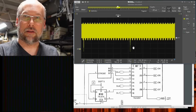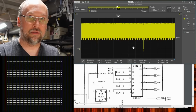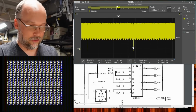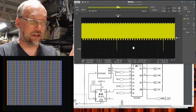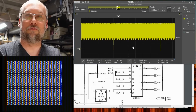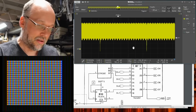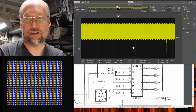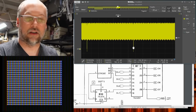Okay, so with the diagnostic running, if we go to the input pin on the 7th bit, there's stuff happening here. The problem is the data input line on all the RAM chips is shared across everything else on the motherboard, including all the ROM chips and any other peripherals. And we have to remember the ROM code is currently running and it's loading bytes out of the ROM, and sometimes there might be bit 7. So that doesn't imply that this is something that's being written specifically to RAM. The only way for us to see that is to look at the RAS and CAS lines and gate that stuff all together.